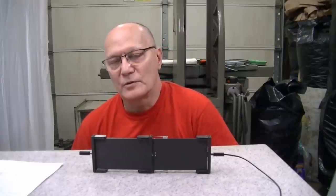Will I have the plate certified? I'm going to certify it with the Renza meter, showing how it's capable of self-calibrating for straightness and will be well within the realm of what an autocollimator or differential levels would achieve. I'll be using the same union jack pattern — running the lines that form that pattern — but using the Renza meter to do it.